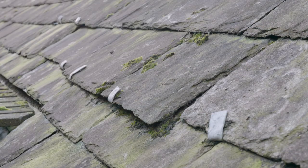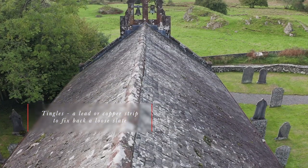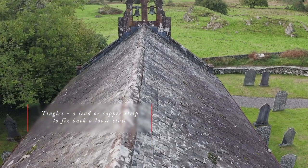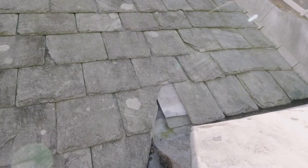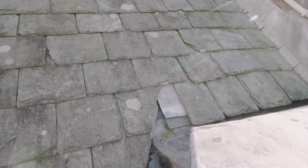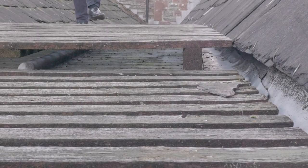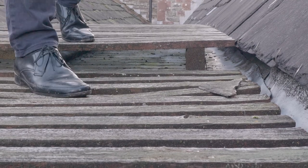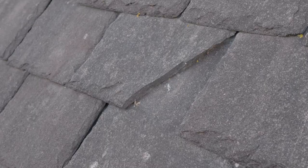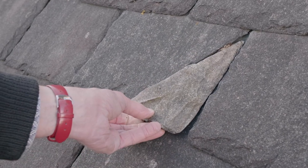You may also find evidence of previous repairs where slates have been refixed using lead or copper wire tingles, although it should be noted that heavier stone slates should have been re-nailed or pegged. It's also worth trying to understand how the damage may have occurred and prevent it from happening again — has debris fallen from above, or maybe the fixing holding the slate in place has failed? Make a note of any issues you find and make arrangements for the repairs to be carried out.